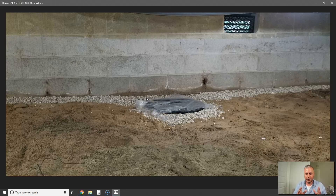If you have your crawl space encapsulated without a good drainage system, you have a vapor barrier down — it's meant to stop moisture from wicking up from the ground. It's not meant to stop bulk water. If you want to deal with bulk water, you need a dewatering system, which is a waterproofing or drainage system — a sump pump, drain tile, and all that — to remove all the bulk water as it comes in.